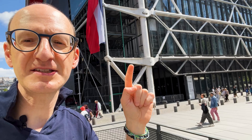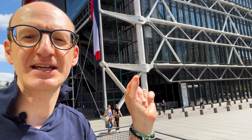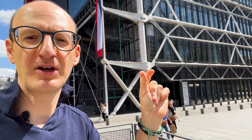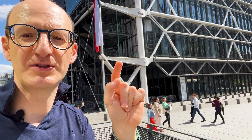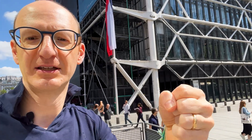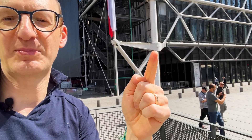These are cast steel elements called gerberettes, and they are fantastically optimized and shaped for the forces in them. A rocker curved part to manage the seesaw effect. And then a moment arm where it's a decreasing moment, so a decreasing section, out to the part where it's grabbing on — a bit like the opposite of my shoulder to my hand. So the reverse of that is happening right there.